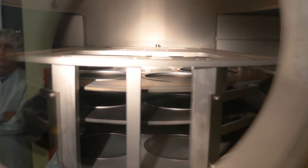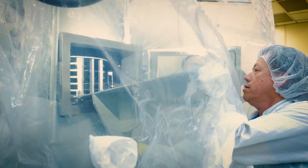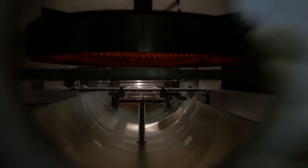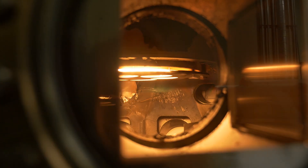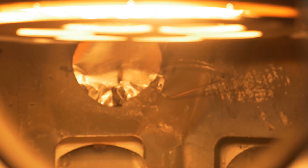We want to have high quality gallium nitride wafers, so in order to do that we have to get our surfaces very, very clean. We put our samples in an ultra-high vacuum chamber and then we heat it up in different stages. The first stage we do a quick bake out to get a lot of water out. Then we transfer over to our buffer chamber and that does an even hotter bake to try and get more water, oxygen, and other impurities out.